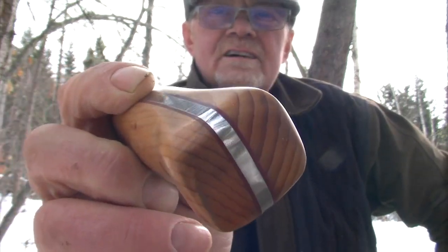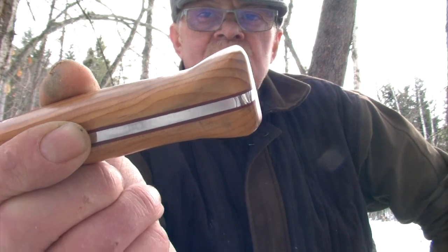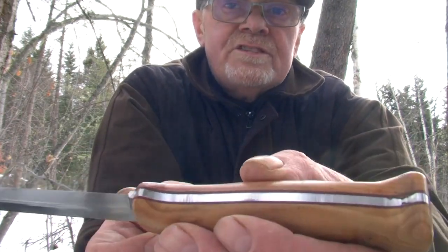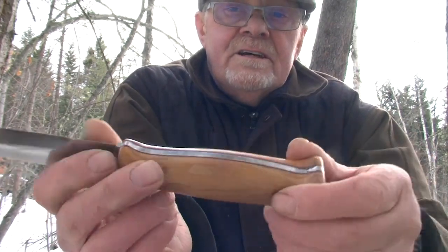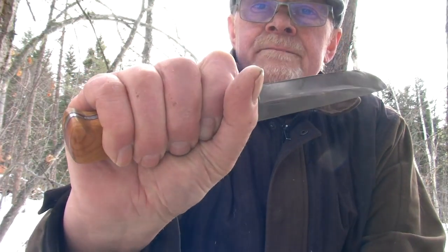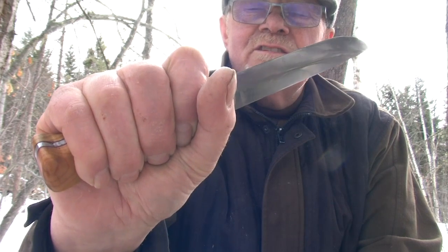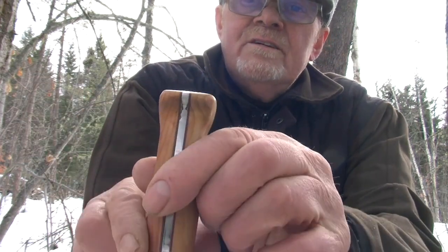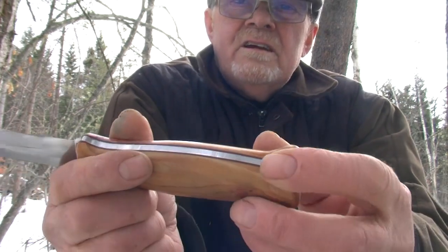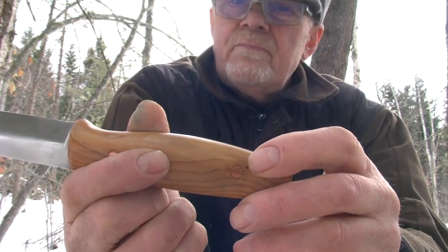And I wanted to make this because I was looking for a commercially made knife that would fit the ergonomics of my hand, but that's, I wouldn't say impossible, but it's quite a challenge, and this one really does fit my hand well. I think it's good practice to have the handle sit in the palm of your hand and just be able to touch the palm of your hands with the tips of your fingers. It's also got quite a pronounced flare on the pommel. I did on this knife put on red fibre scales, which I think kind of sets off the orangey red in the yew.